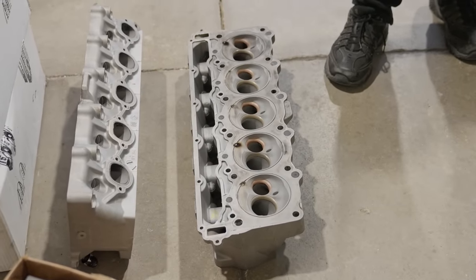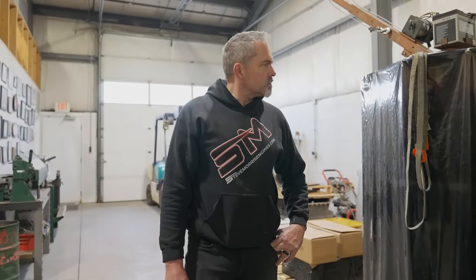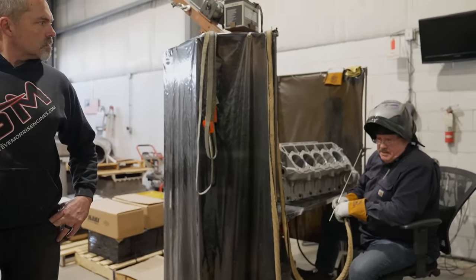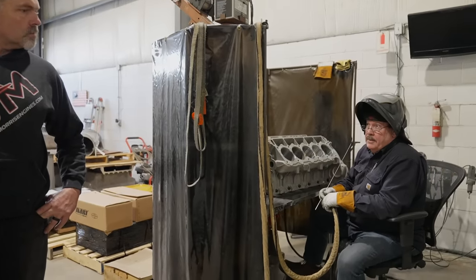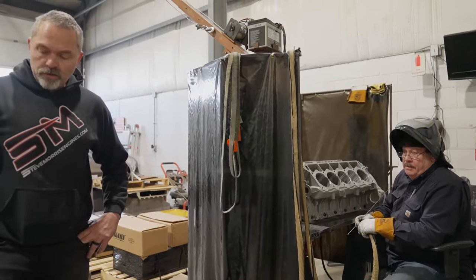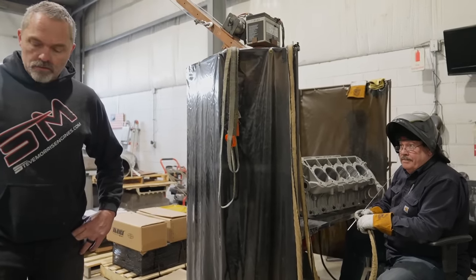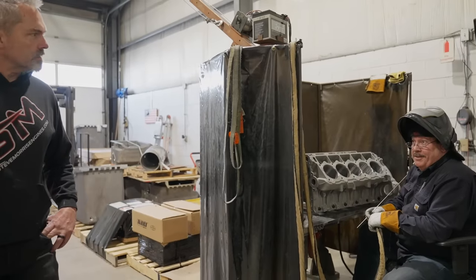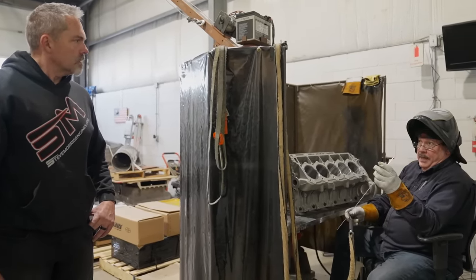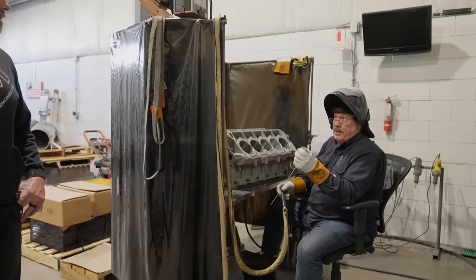But I would like to probably weld them out. Do you actually add material or you just put heat in? Melt them, especially on that beryllium, because that's 65% copper. Oh, and it'll just melt right away? Typically does. Really? No, I've never done that. You just hit it with a TIG torch and just knock it out. Save a lot of machining tools. That would save a lot of time, tool bits and a lot of time. Yeah. You got to be quick about it. You got to get on it, melt it, because you don't want it to transfer the heat to the bore. Right. Screw up the bore.